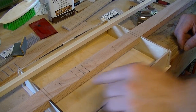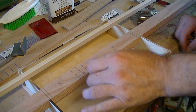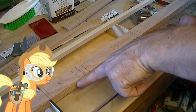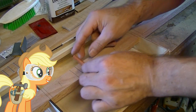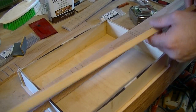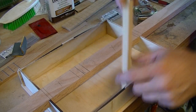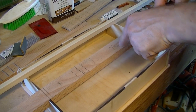So you might be wondering what all these marks are for. Right here is 25.5 inches. To get this lid to resonate, you need to have this off the lid, so we need to hog this out a bit with our router — these marks show how much I want to take out. I've left this area because I want the bridge to have full support underneath. I also want to make some supports in the corners to prevent the lid from being too flimsy and to give the box some extra sturdiness. We're going to cut six of those.